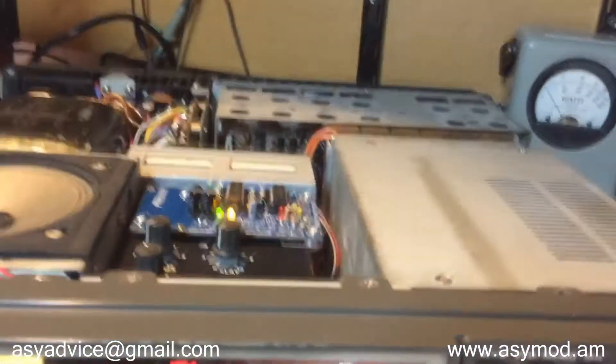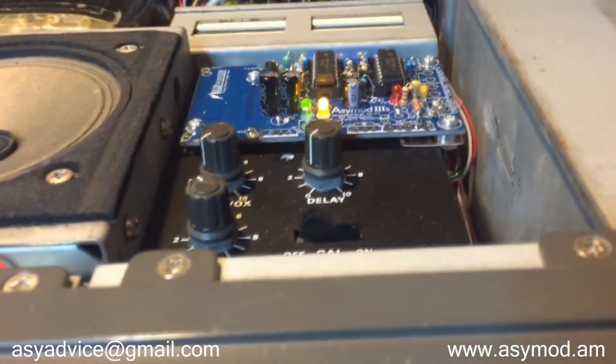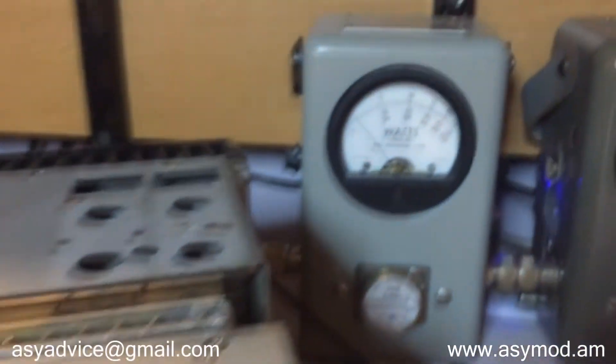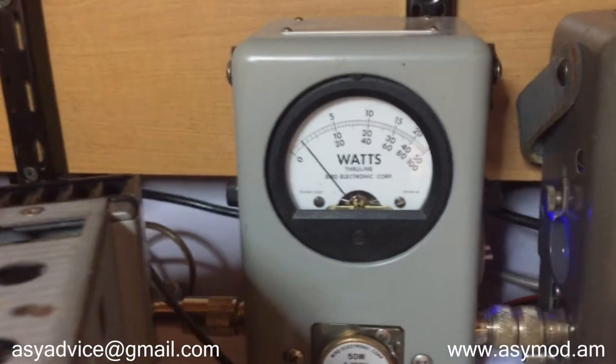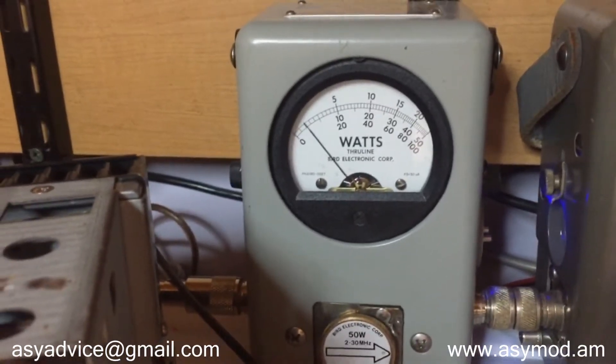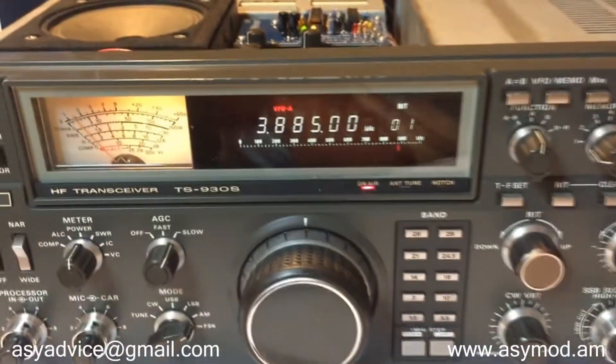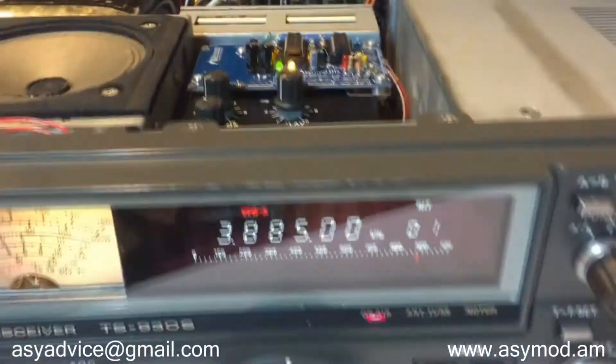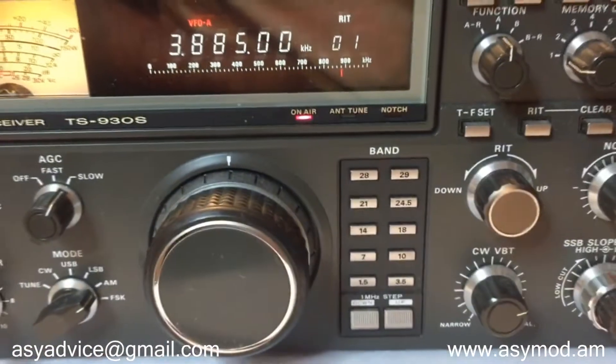The asymmetry can be raised up to 300% and beyond at this carrier level. It varies a little bit from band to band, but we'll take a look at 40 meters now. We're not going to touch any of the adjustments on the ACMOD — we're going to leave it just like it's set and go to 40 meters.